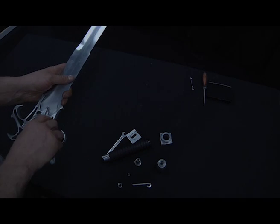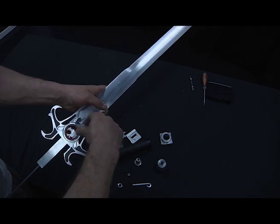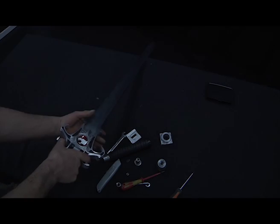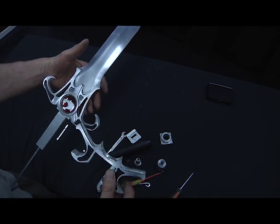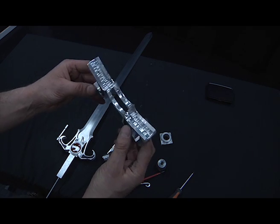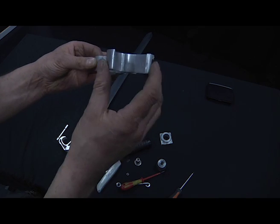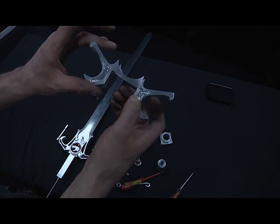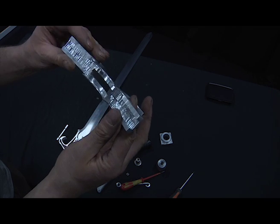Under these caps are the screws holding it to the nuts on the back. I forgot to mention — this piece slots over. These two bits were quite difficult to make. I used a milling machine on these — you can see how rough it is. Manually milled it, the same with these sections in here. The outer surfaces were obviously cut with a bandsaw, and it's effectively just two pieces laid on top of each other with bolts behind there. You can see the back of them just through that section. That's what it looks like after it's been milled, so I do need to do a little bit of sanding on it.